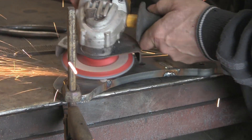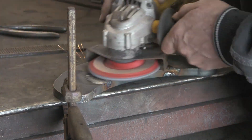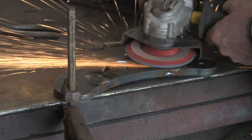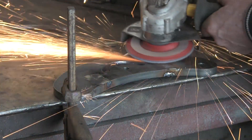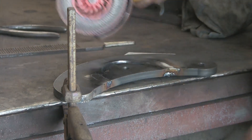Sometimes when you fill up holes like this you get voids, and I want to make sure it's completely filled up because that's where I'm going to drill and tap again. I'm just adding a few little bits to bring the edges up. We're just going to quickly grind it off. This disc has had it - it's not cutting very well, it's actually clogged right up.